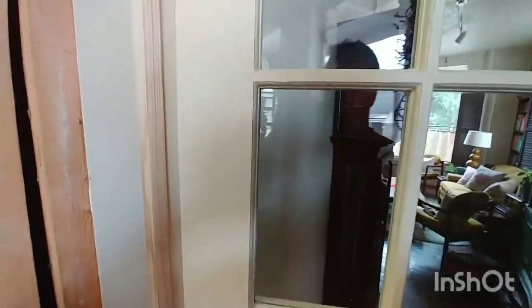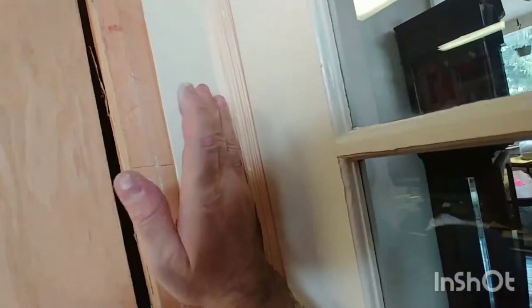Another thing to mention about painting stop is that, like I said, I was going to install it when the door closed. The slab, I had Katie make sure it was nice and flush, and I put the stop up to it. But then I left, if you can see, a bit of a gap. We're looking for a bit of an air gap. It's a bit there, even more. So 10/1000ths of an inch or more is nice to have. 20/1000ths is even better, because I'm going to end up adding paint to this, and it scrubs.